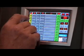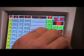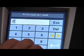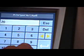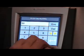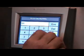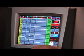So step 1, before you start the steps, you have to set the speed of rotation and the length of time for it to rotate in each direction. So we're turning the anti-clockwise rotation on, and then we set a speed of 20 RPM, enter it, and for the clockwise, turn that on, set a speed of rotation for 20 RPM, and then the time anti-clockwise, we're going to have it going that way for 5 minutes. And again clockwise for 5 minutes.